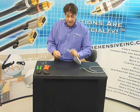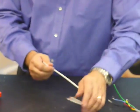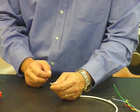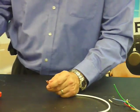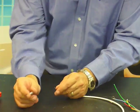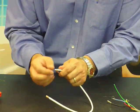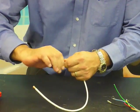As you can see, I have my coax cable, which I've already stripped back to reveal the braid. On this side, you push the braid aside and strip back the dielectric so you can see the copper center conductor. You need to slide your crimp ring with the large side facing where the conductor is going to be, place that over the cable, and now you can bring your shield down to make contact with the connector body.